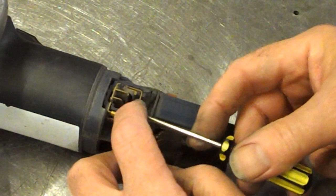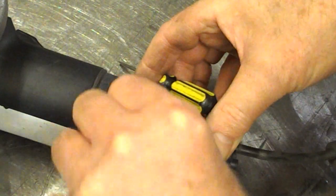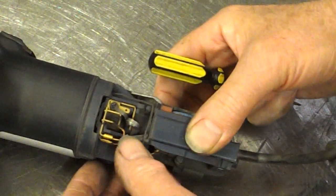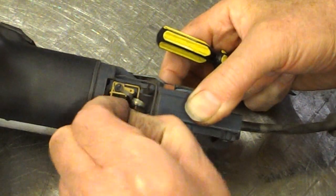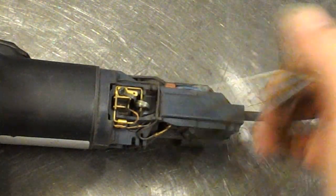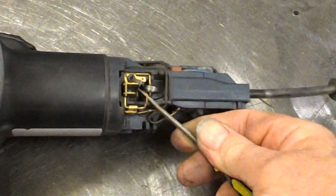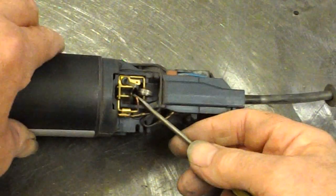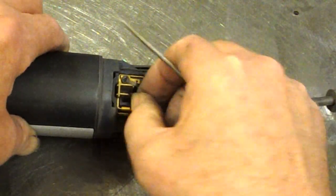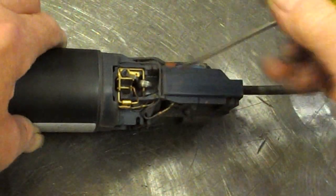It is well down in its groove. Oh my word! You know what? That might have even gone worn out too far. This used to have a kind of safety trigger in the brush itself, where there's a little spring-loaded part that would pop out and break contact, and it doesn't look like these have got it in here because that has worn out so much.